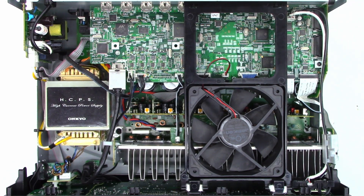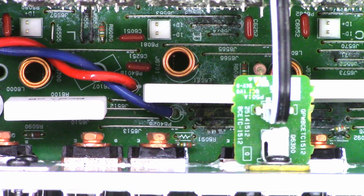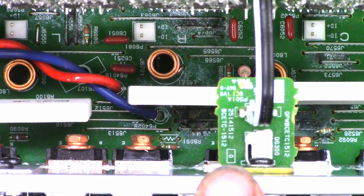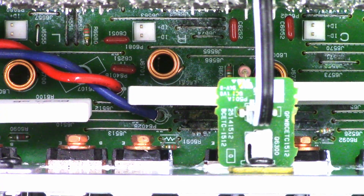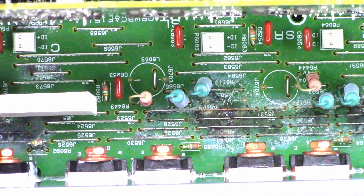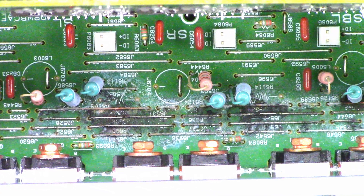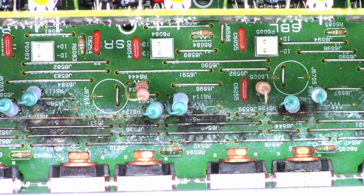The customer states that it turns off and on. Let's go ahead and get this fan out of the way so we can take a look down at the amplifier board and do a quick visual inspection. Right down there I see a bunch of corrosion. Also right down there — oh, this thing is nasty. It's been wet. That might be part of the problem.